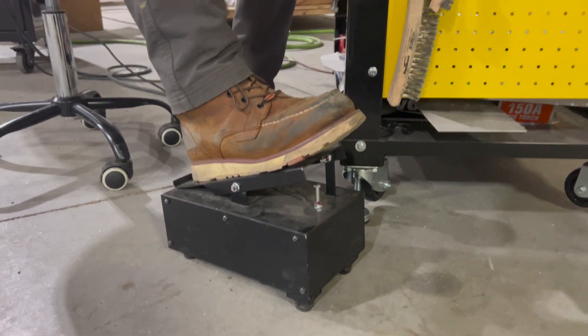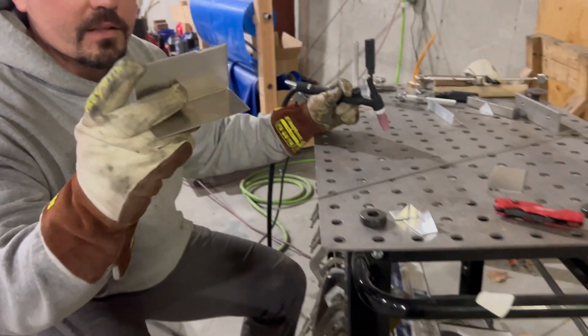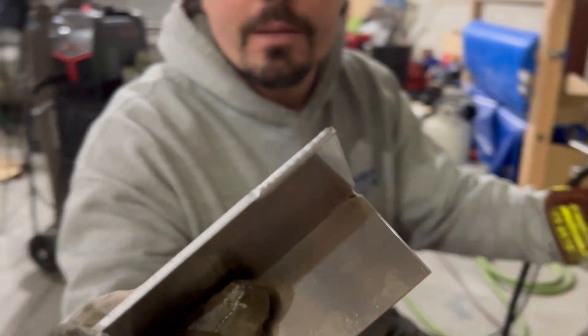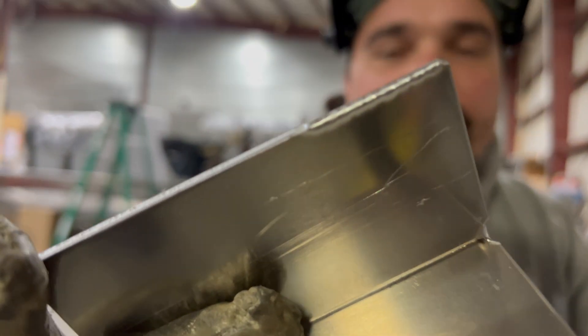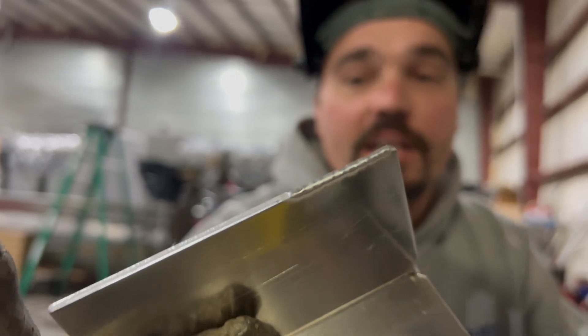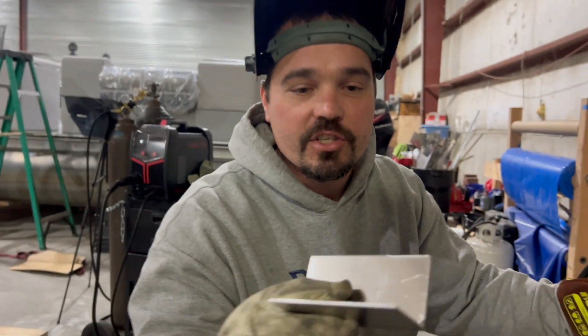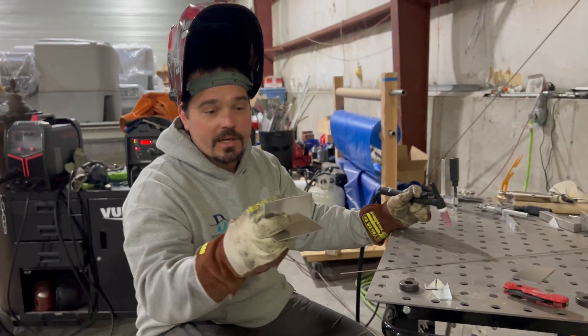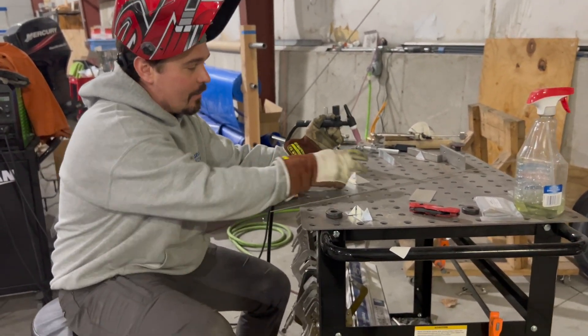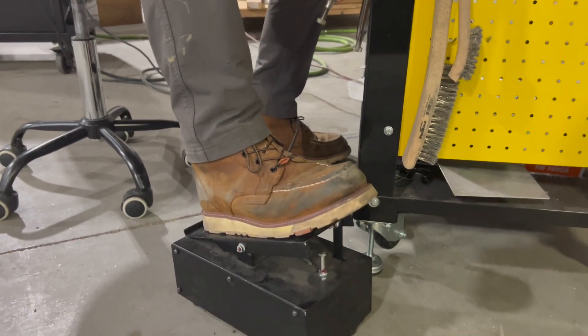And if we come up top and look at that aluminum, it's basically just a little baby bead with no filler added. But this is just getting me comfortable with arcing up, especially on an open end. Again, this is eighth inch thick. So what I'm going to do now is go to about halfway — it's pretty hot now. You're going to watch me hammer down a little harder and try to melt this down just a little bit.